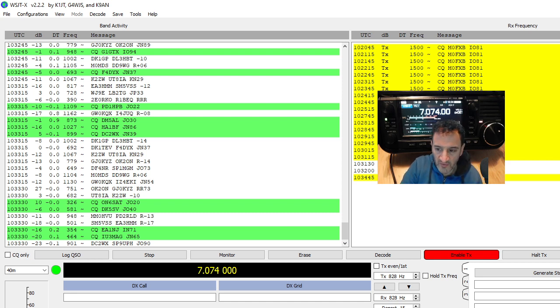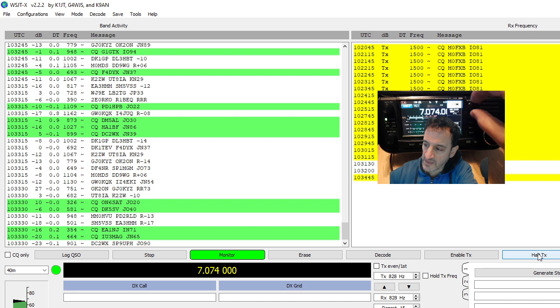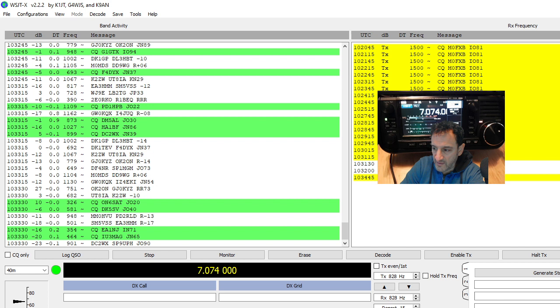There's still no ALC there. Normally I'll just move this slider up or down and it would give me ALC. Let's get the power down to two and a half watts and click Tune again. I can see the power going up and down but the ALC isn't responding. Funny, weird the way it reduces like that.